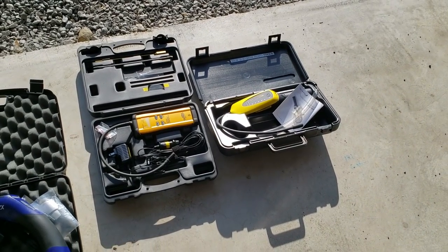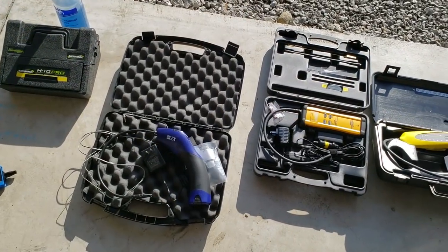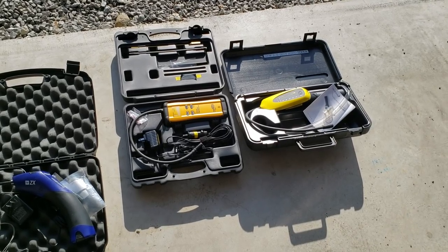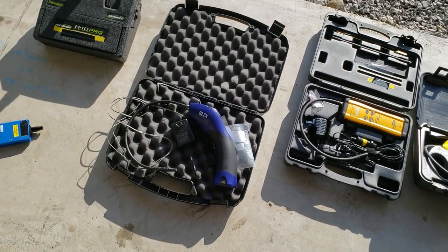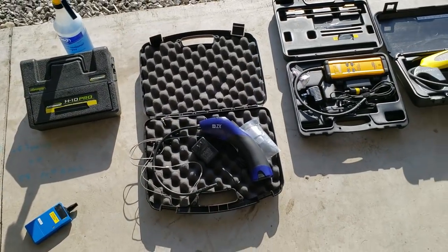The infrared has a long sensor life. It's not as sensitive as the other detectors here, but it doesn't false alarm. I did not like the heated diode Fieldpiece unit. It false alarmed on just about everything, and it became more of a nuisance than it was worth. The TIF here does a pretty good job. They claim that it can't be poisoned by overexposure to refrigerant, and it has the pentode diode.